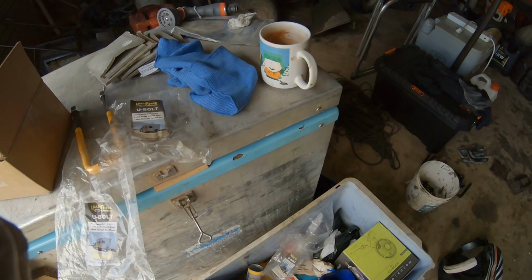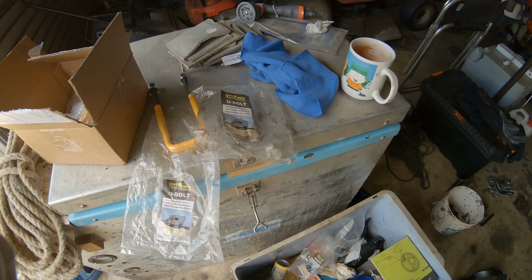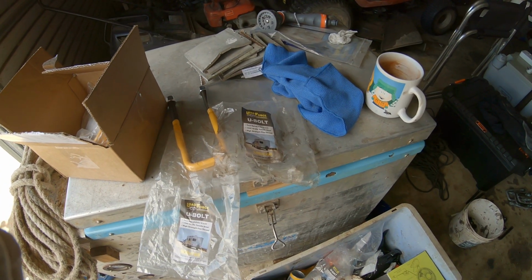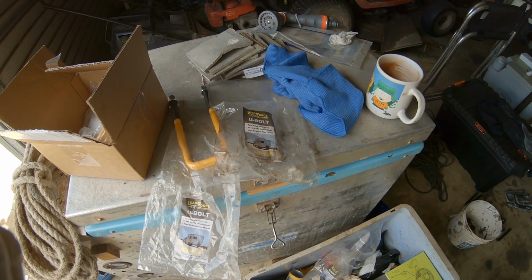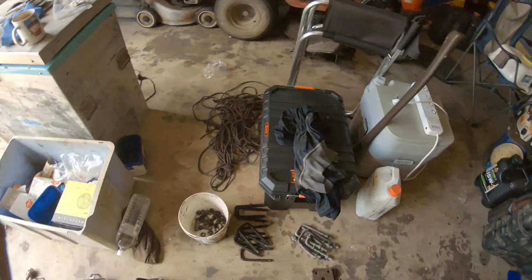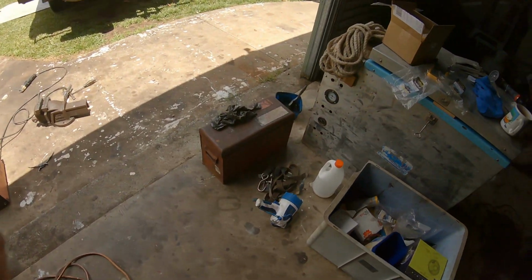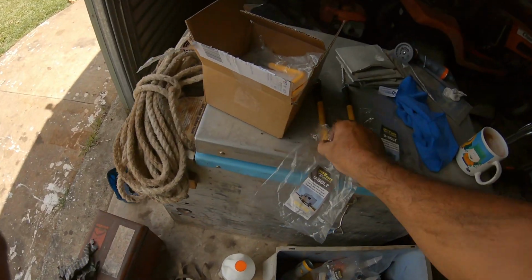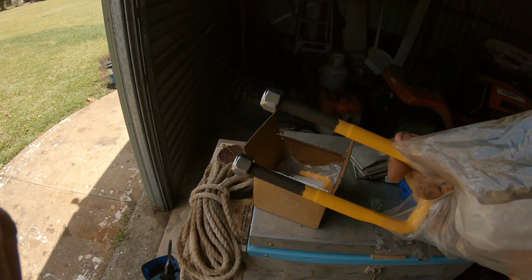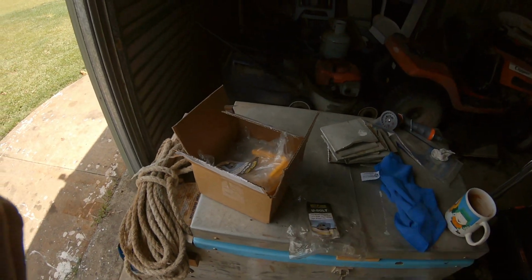But my old U-bolts were only 10 mil. That's all they were. These are 12.7 mil, and they're 1045 grade high tensile steel and fine thread. So they're a bigger U-bolt by nearly 3 mil and a lot stronger. So like I said, I bought these. See, there you go, that's the size of them. They're a proper half-inch, but even a fraction bigger than half-inch.